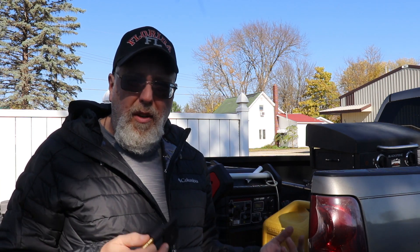Welcome back to the channel. Today we're going to install something on our Predator generator that I think is going to make a world of difference. A few days ago I went through and bought the Nash fuel system, which is going to convert our Predator generator to run natural gas or propane. Since we're going to use it as a camping generator, I want to set it up for propane. I chose the Nash fuel system because I'm still able to keep the original carburetor, so if I'm running gasoline it still has the electronic solenoids on top — if I bought an aftermarket carburetor it would not have that.